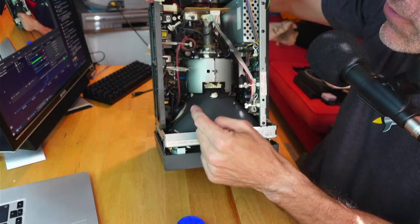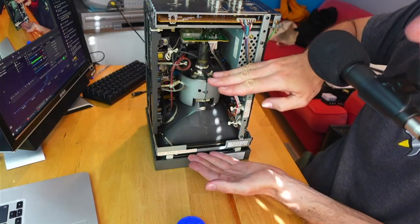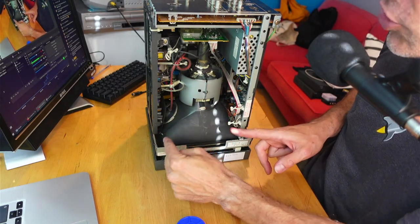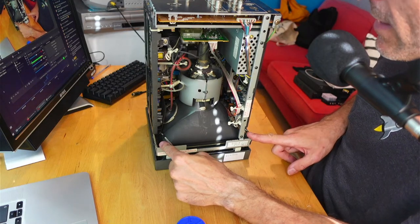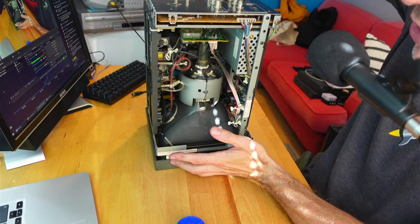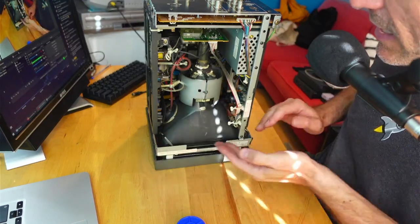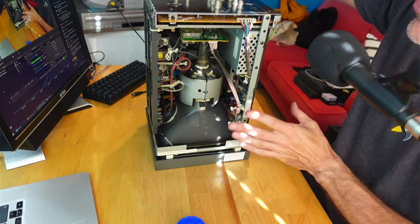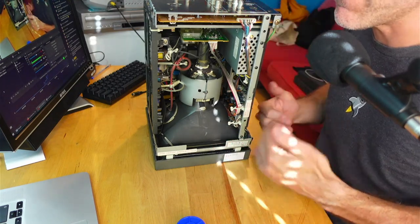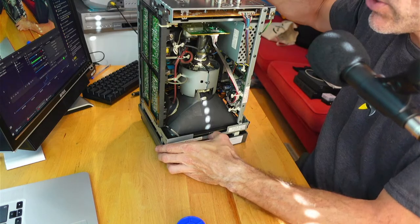If you have a really short monitor, this angle becomes much larger. It's got to go out there, and that makes geometry at the edges really hard and not so good. So if you have a longer tube, then this angle doesn't have to be as big, and it's easier to get geometry at the corner. That's why these small ones are very long, and in my experience most BVMs are longer than your average consumer set.